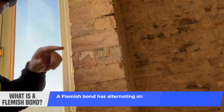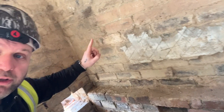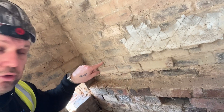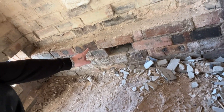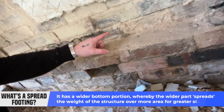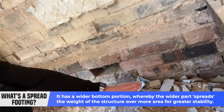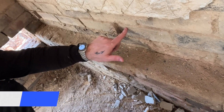There's no cavity — it's a solid wall. That's how they used to be built. On a spread footing, this wall is the same — a nine inch wall, with bricks going across on a stretcher and some going across as a header. And below that you've got more bricks, and this is where the spread footing comes in. The thicker bricks at the bottom make it wider — you can see how this section is a brick wider than the top.